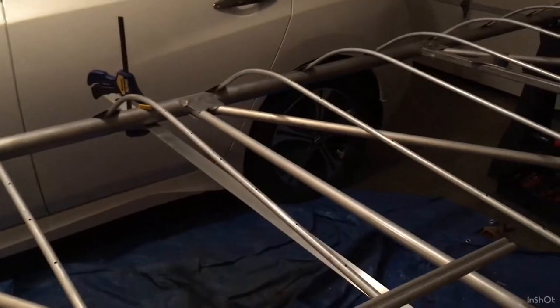Beginning the install of the trailing edge ribs. I've got this aluminum sheet — it's pretty firm — supported against the leading edge spar and the trailing edge spar, which flattens out the trailing edge rib nicely. Sorry it's so dark — it's really raining outside so I'm in the garage tonight. The small tubes get attached here and there are seven of them. I got the first hole drilled in the top and I'm about to rivet with SS-44 rivets for the spar and SS-42, the smaller stainless steel rivets, for the back.